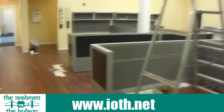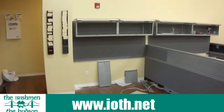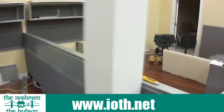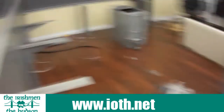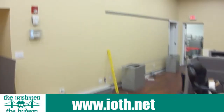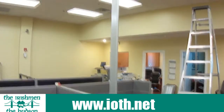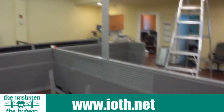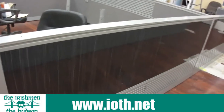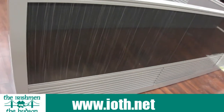Welcome to the site — this is lunchtime on the second day. As you see, the workstations are starting to pop up. We've got the overheads up on this first station here on the back wall. That's one of the work surfaces that will be mounted — these are the cantilevers that support the work surfaces. Over here, we're building a whole slat wall, and then files along the way. We've got the power pole up to bring electricity from the ceiling down to electrify these four stations. The client picked out a really nice laminate here on the aisle with a matching trim for the base.